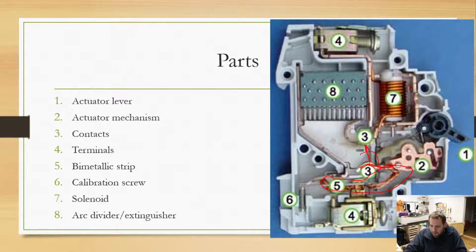And also remember, this contact here moves extremely fast. That thing is spring loaded. It's not like I'm just going to half open this. No, normally it's a nice little clunk mechanism that instantly latches that thing. But as you break, that arc forms, and we don't want it to stay here. We want to dissipate that, and the easiest way to dissipate an arc is with more surface area and distance. So as you can see here, that arc then wants to move this way, because that distance is smaller than this distance as it's opened.